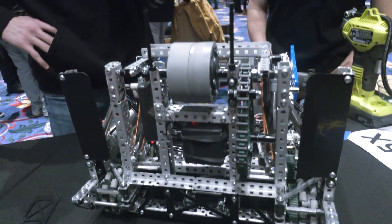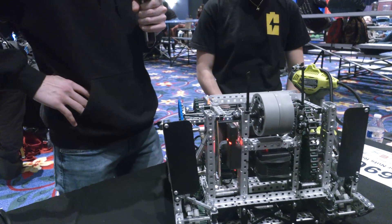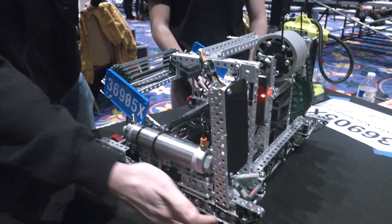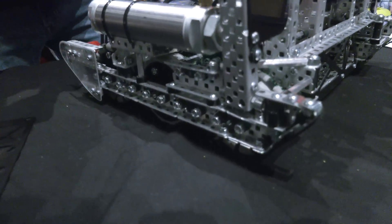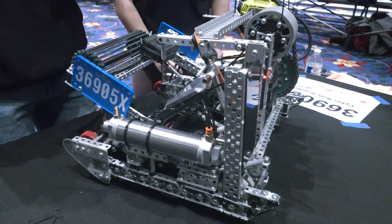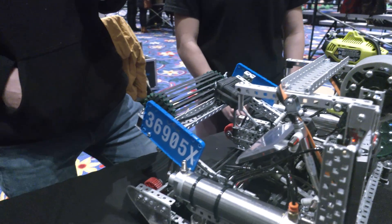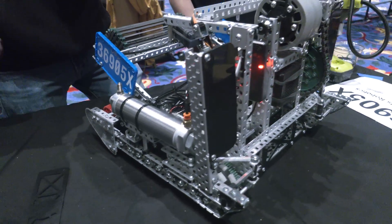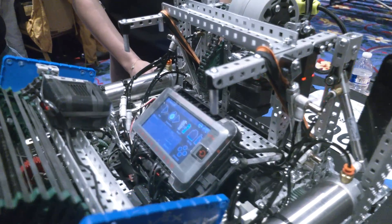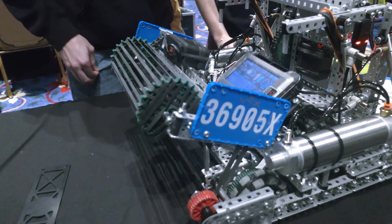Overall, when you approach the Over Under game, what were some really key things you wanted to accomplish from a build quality standpoint? We really wanted to be small this game. Our drivetrain from front to back is 24 holes long — pretty small — which gives us plenty of room on either side and allows us to get around the field a lot easier. It's also harder to defend against a shorter bot. And we really wanted to be durable this season because a lot of bots going over the bump just get really shaken up. Things like angled standoffs and custom brackets we cut out of aluminum on the five-wide plates hold the bot together really well. Everything on here is lock-tited so it just doesn't fall apart.